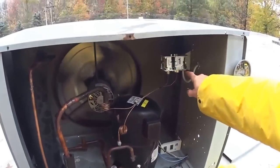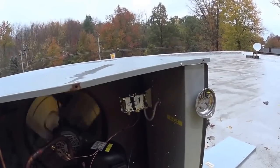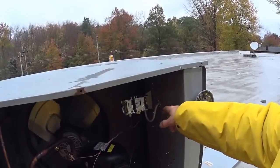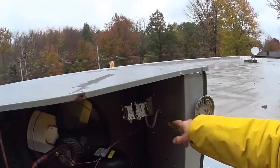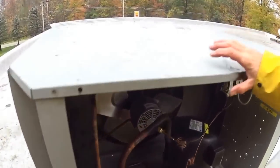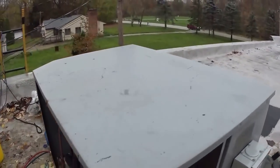It just went off on its pressure control — it shut the contactor coil off. The contactor coil runs through the pressure control. It goes from L1 through the coil, through the contactor, out of the coil, through this pressure control, and to L2. The pump-down solenoid is working downstairs and she's holding pretty good. Now I'll take it off frost.